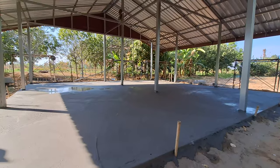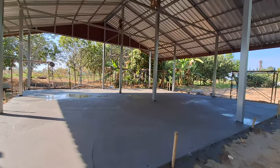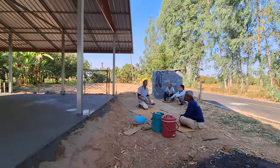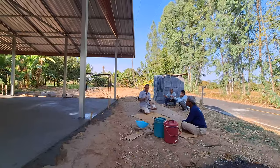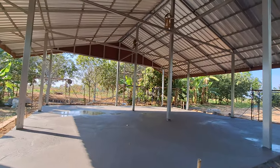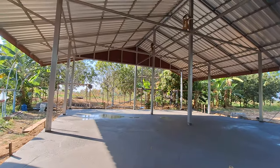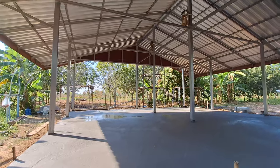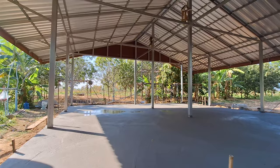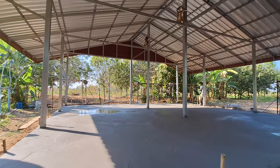It's poured and the primary level is done. The guys are having a beer — we're celebrating having got to the concrete stage. There is a little bit of troweling they're still going to do. By the little bit of water still sitting in some places, it suggests there are some lows and highs. We are going to use ceramic tiles, so we'll do something with a bit of self-leveling cement prior to putting those in, which will bring it up to a level surface for the tiles.